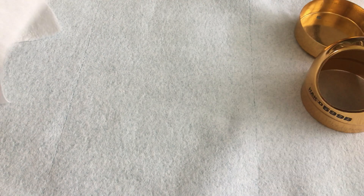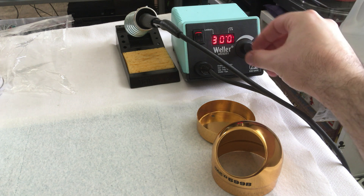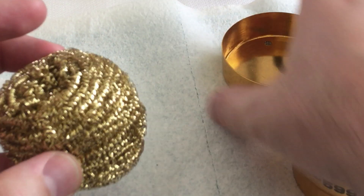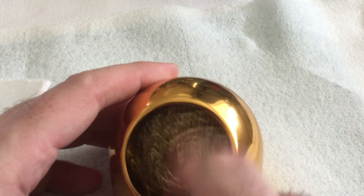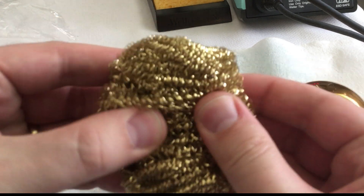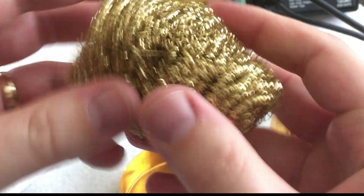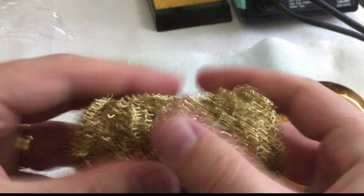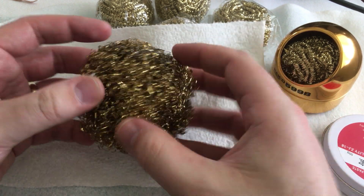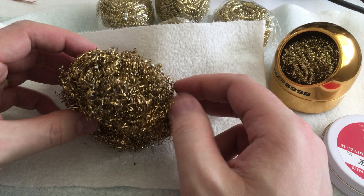Next I'm going to turn on my iron and get it up to 300 degrees — that's the temperature I like to work with. While that's warming up, I'll go ahead and fluff this sponge, because if I just put it in as-is it's too loose and moves around too much. I like it to have a little tension. It stretches really well in one direction, not so good in the other. The old Hakko seems to have stretched pretty uniformly.